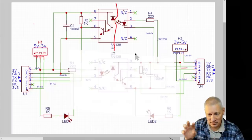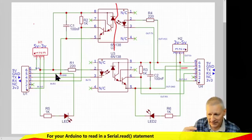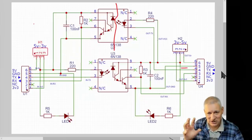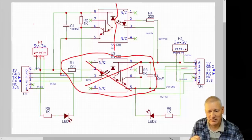The other half of the circuit is the exact opposite: when your PC wants to send something to the microcontroller, it does it via the infrared LED in the other chip, and the detector side sends it into the microcontroller. If you never send anything to your microcontroller — as I suspect 99% of the time you don't — you do not need this second chip, its resistors, or its capacitor. All of that can be omitted.